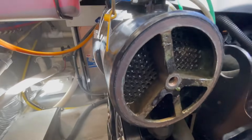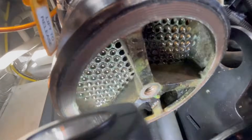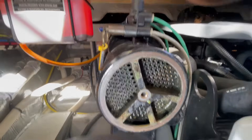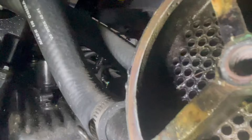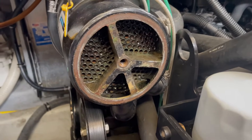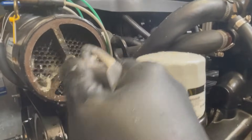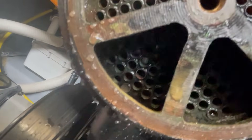Okay, there's the inside of the heat exchanger — that's the raw water side. The raw water comes up through that orifice down here at the bottom and flows through the heat exchanger, which doesn't look too bad. I don't see any debris in there. I removed the back cap from the heat exchanger so we can blow air through the tubes and make sure there are no blockages. There's a little bit of blockage there, but we're just going to quickly blow out these tubes with some compressed air. We blew out all the tubes and you can actually see the flashlight come through the other side, so we look pretty good here. Got this all closed back up.